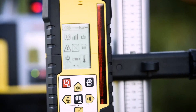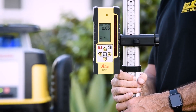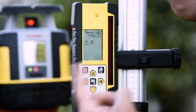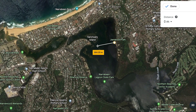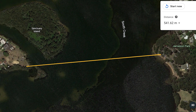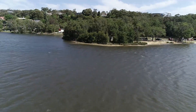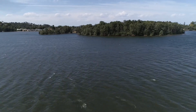You can see here we've got the oversized 120-mil sensor, which is part of the reason why this laser and receiver combo picks up such massive distances. Another cool feature is the sensitivity mode — if you're working on a busy work site with excavators, loaders, and dump trucks coming through, you can turn the sensitivity up or down so the laser doesn't get impacted by those heavy machines. With the combo receiver, the laser has a 675-meter range, giving you a diameter of 1,350 meters on a large work site.